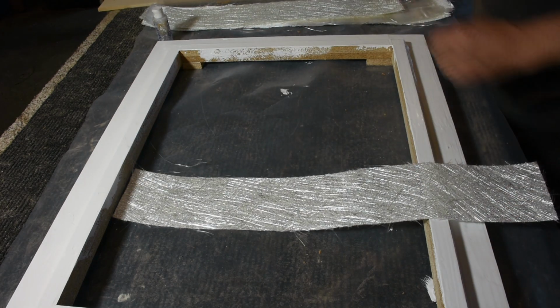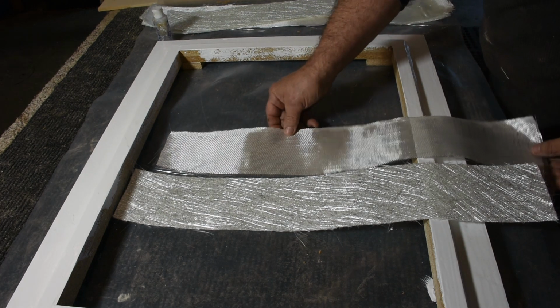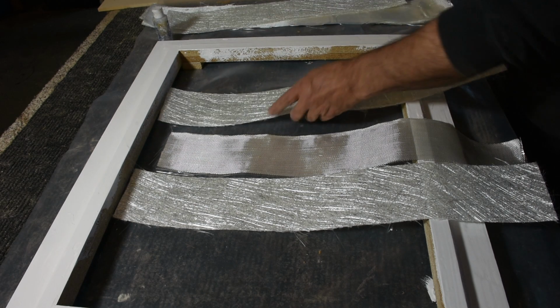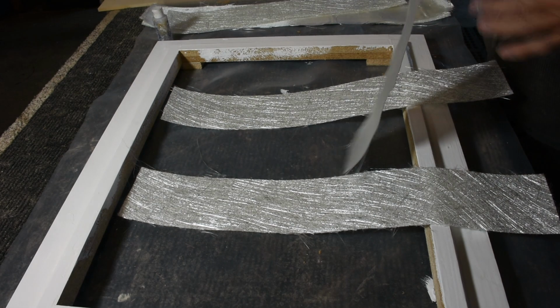We get all the gel coat down, and it's sat for a couple hours. And now we'll be getting ready to lay on the mat. So what we use is mat, cloth, and mat, and that's classified as one unit. We'll be putting on 2 units, and I pre-cut them all to the corners that they overlap.